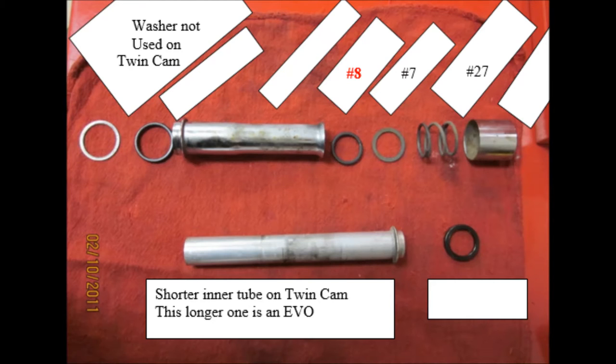The steel spring actually creates support when the clip is on that cup to hold the assembly together so it doesn't vibrate apart and doesn't require any mechanical fastener like a bolt. The steel washer's job is to stop the steel spring from pushing through the o-ring. The outer tube has a flared edge — with that flared edge, the o-ring will cradle in there and create a nice seal. The steel washer goes on top, the steel spring goes on top of the washer.